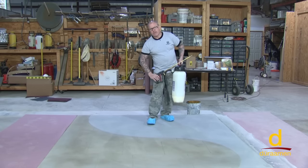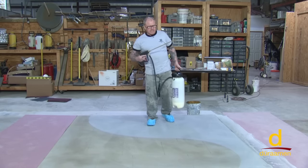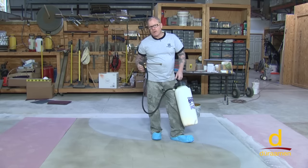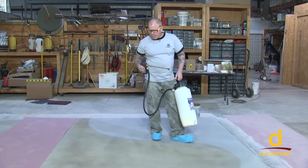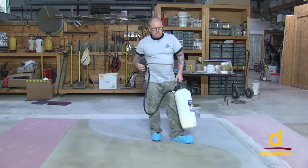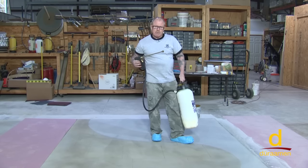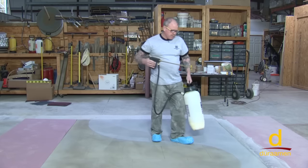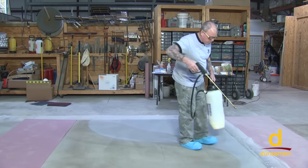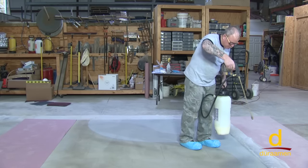So what we're using is AO3 water-based acrylic. It is important — normally I like to back roll a water-based acrylic, but if we back rolled it could bleed the color like we talked about. So we're going to use a sprayer here that really atomizes the AO3. This is a non-drip sprayer, so we're good. I'm just going to go and start applying it.